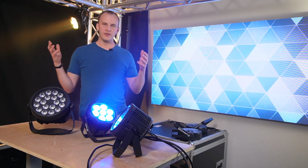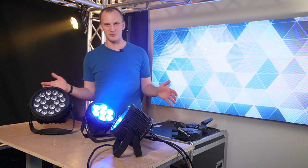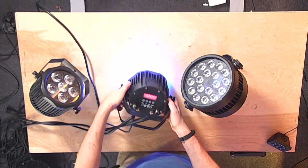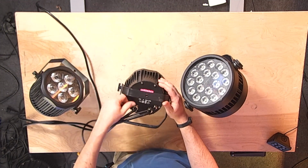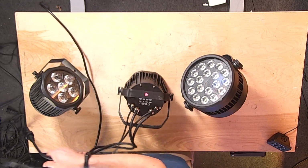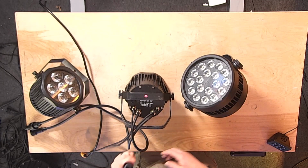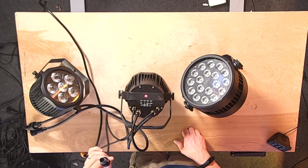Okay, so this guy's really cool because you won't see the Gamma logo on it. You'll see a little Christmas tree because it is outdoor rated. So it has on the back of it attached wires. Okay, so the attached wires are for DMX signal and power in and through. It then comes with the adapters to take this little waterproof plug, this is the power through, or the DMX plug, and adapt it to a standard 3-pin DMX, a standard Edison power.